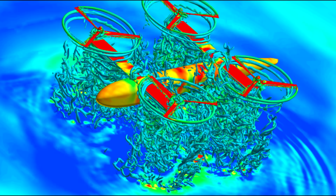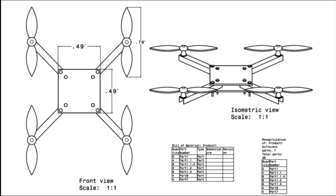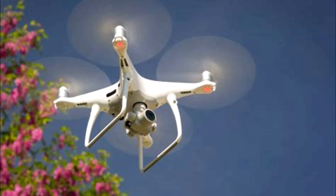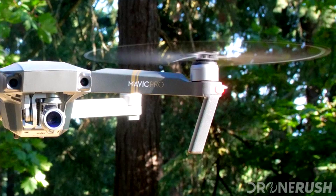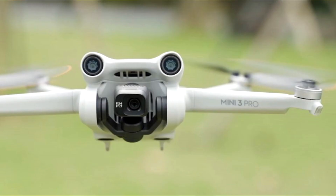So what do I think is going on here? My argument is that a lot of the noise is likely due to mutual interference rather than the rotors being noisy by themselves. That is, if you could actually run these quadcopter motors in isolation up in the sky, they probably wouldn't be all that loud. But if you get them all close together, they get really noisy. So here are some modifications that might reduce the noise: we should probably avoid having the tips of the blades get close to each other, so the discs should have a minimum distance to prevent interference noise. Moreover, that also applies to the fuselage — the tips shouldn't pass anywhere near it. It's likely unwise to have the discs overlap with a vertical offset between them. Finally, rotating the discs so they're not parallel to each other might make a big difference, because the sound they generate won't propagate directly into each other, reducing the likelihood of constructive interference.